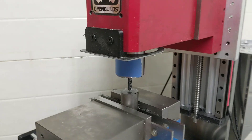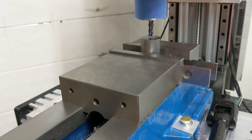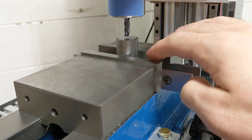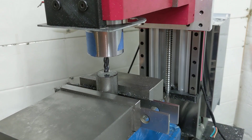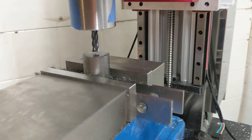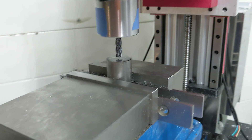The number one thing people have been asking is: can it cut steel? So I bought some steel and we're going to try it. I've been taking a few cuts here. This is just a 4-flute cutter from Amazon - it's coated carbide of some kind. This is 12L14, just bar stock.